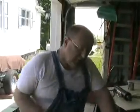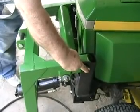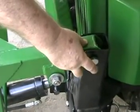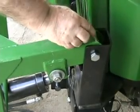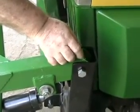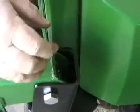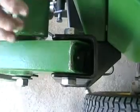Alright, when you start to put your machine together, you're going to have a bushing in all the points where it swivels. So you want to tighten your nut tight enough that you actually squeeze the U-shaped piece of channel against that bushing. You don't want the rotation to be on this nut and that bushing. You want it to be on the part of the arm that contacts that bushing and has the grease zerk, because you want the grease to protect that piece of bushing from wearing out. And so to do that, you want to put a lot of pressure on it and tighten this thing down good. And you can kind of tell because you can look down in between here. When you first put it on, you actually see daylight down there, but as you tighten it up, it squeezes this down and it seizes right in there.